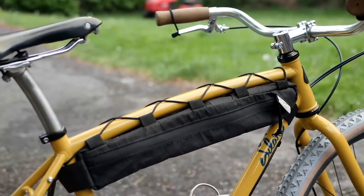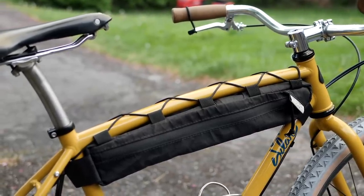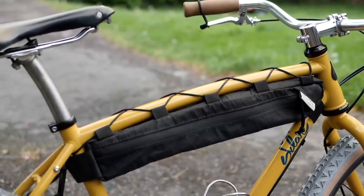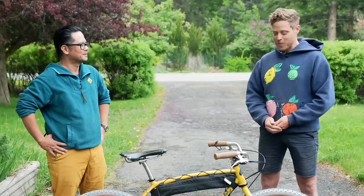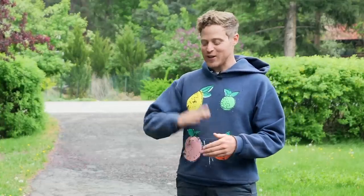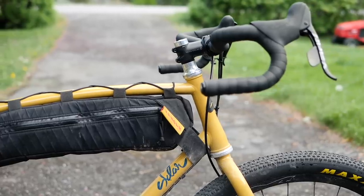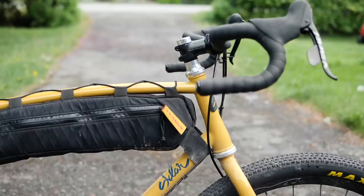I think one of the things that you're known for visually is the swoopy top tube. Is that purely aesthetics? Does it add something? Is it just a visual signature? Yeah, it's turned into a visual signature for sure. I always liked that you could tell one of my bikes without paint on it was sort of the goal. But originally I did it because they're ovalized too, and for ride quality, I like that. It's like a beam. It flexes more up and down and is stiffer in the steering axis. Add some flex, and I think it's nice to have a unique looking bike. It's a lot of work to make a bike, so you might as well have it look cool in the process.